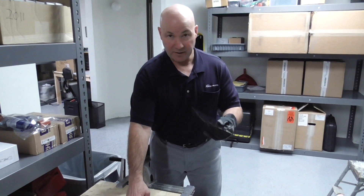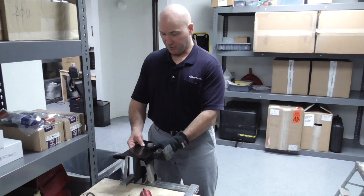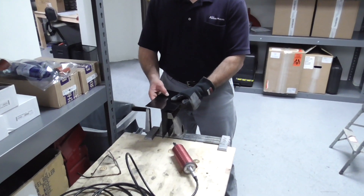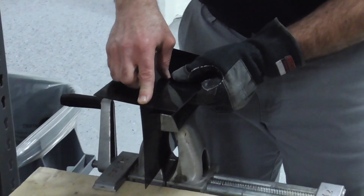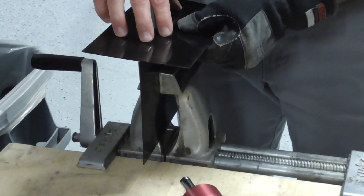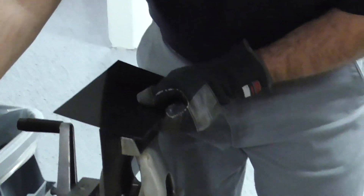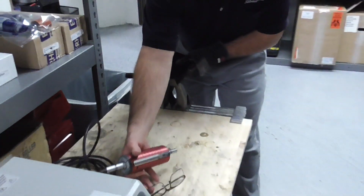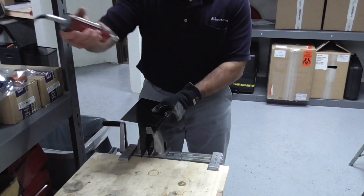What we want to do today is we've got two little pieces of polypropylene. We're going to put them perpendicular to each other and try and weld it right on top of there. I've got one secured, and I'm going to hold the other one while I'm welding. We're going to start with the standard flat tip that comes with the machine and see how that works. If it doesn't work, we'll try some other tips. So here we go.